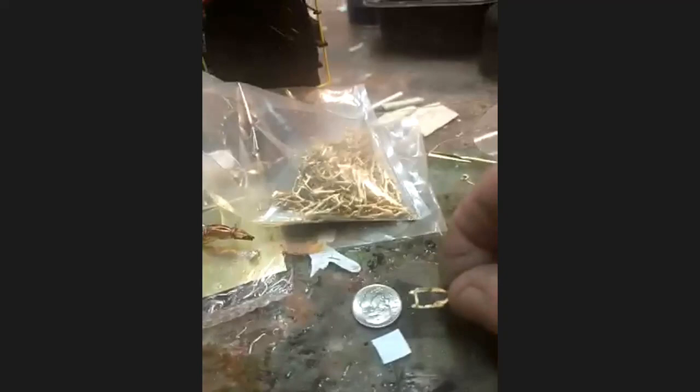Okay. Here are the front windows here. Now, let me unfurl one. These are castings made from my own patterns many years ago. Right there, the things that are on my finger are called sprues. They get cut off. And then these two little things up here are actual hinges. And you can see, here's a dime, right? So this ain't very big. And I put a little 0.05 piano wire through these.